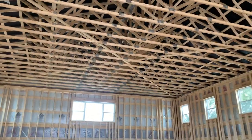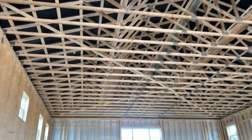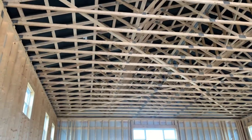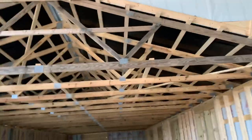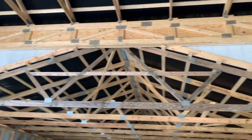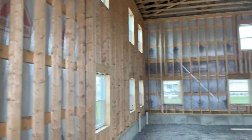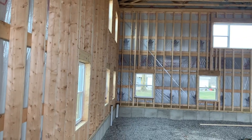This will be the goat section attached to the garage. You can see right there — we did a two by six bottom cord and spanned those four foot on center on the garage section of this building. On the home section, we put two foot on center truss spacing and used a vapor barrier up top. On these trusses right here — again, that 32 — you can see we put that girder as a header on top of there.